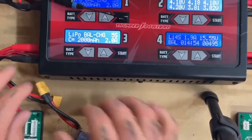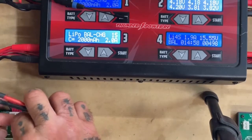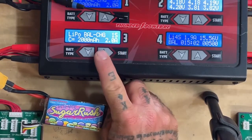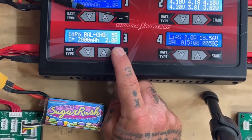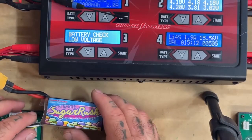What you're seeing is the bottom part of my Thunder Power RC four-port charger. That doesn't matter what charger you have. What's important is the following: here is one of my Thunder Power RC — actually, this is a 5S Sugar Rush LiPo. And I don't know why, but it literally has zero. There's nothing. I can't even get it to light up, as you can see right here. I got nothing. And when I go to plug this in and charge it — I'm sure you guys have seen this happen — I change it to 5S and you're going to get this error right here. There's barely any voltage on here.